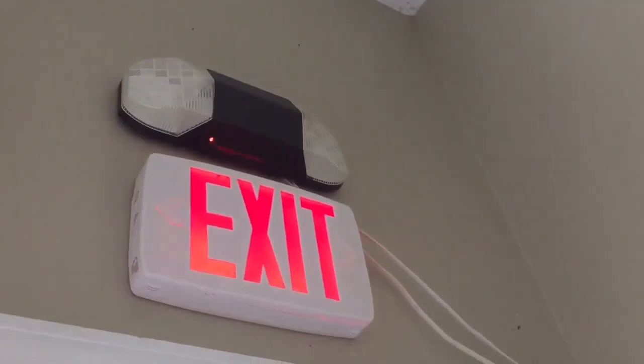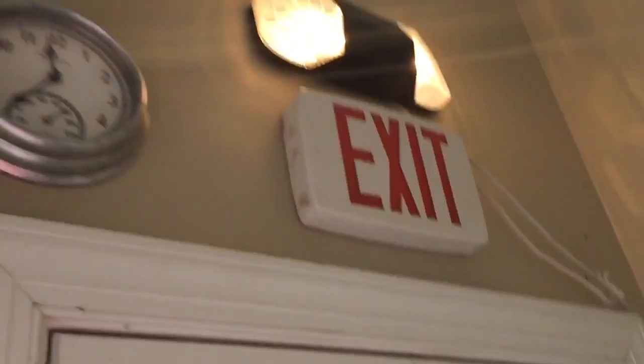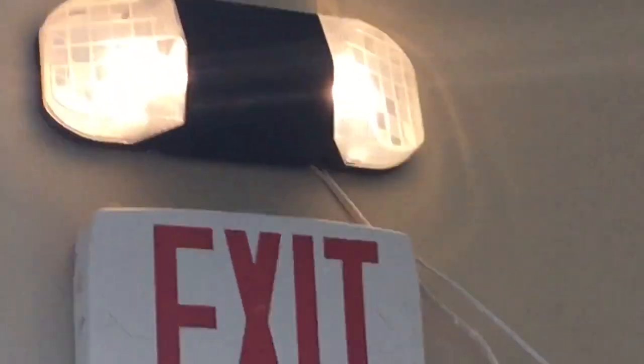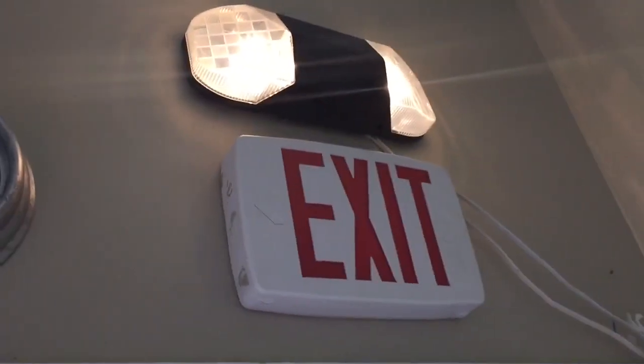You've seen this in the past and how it worked in the garage, since it's the same mounting height. I'll set this to emergency mode so you can see what it looks like with a fully open garage at around 11:35 at night. Obviously the exit sign is out and the emergency light is on. This is probably as realistic as it gets — this is exactly what I'm seeing. Really, the only thing it's lighting up is itself and the wall barely. Not even the ceiling; the door isn't even lit up. At least something incandescent and adjustable could do a little bit — but this emergency light frankly doesn't do a thing at all. That's why these really aren't the best.